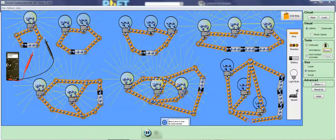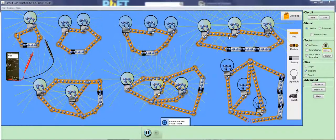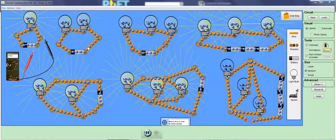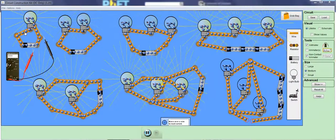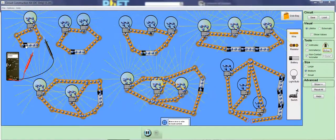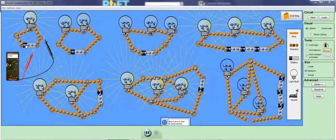Okay, now we're going to look at parallel circuits, and I've left our series circuits up on the top so you can compare the circuits from the parallel to the series a little more easily. We don't have anything like a one bulb parallel. There's no such thing. One bulb or one resistor and one battery, connecting wires, simplest safe circuit, it's series, everything's all in one row, period.